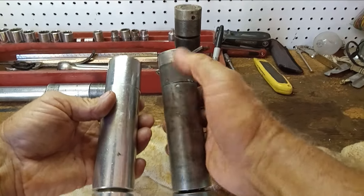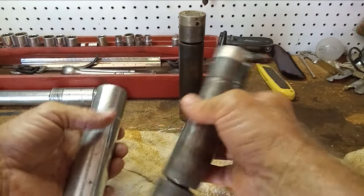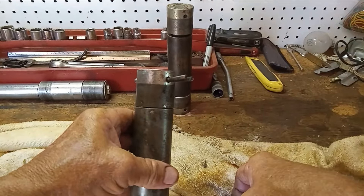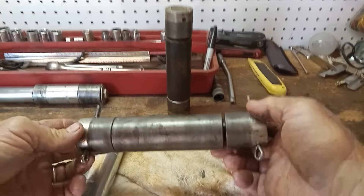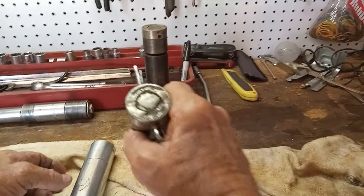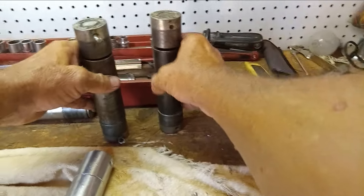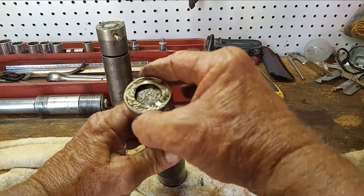When this is enclosed inside that sleeve in the boom with these cotter keys holding these caps on, the only catastrophic thing that could happen is if you lost or sheared off a cotter key — then this piece would obviously come off and bad things may happen because it could all fall out. But other than that, that would be something very easy to monitor; you can see the cotter keys very easily on the machine. And it amazes me — think about this: during seven and a half years of operation the cotter key held up, but the weld broke. You can see the crack, and on this one that doesn't have the cotter key, it will come off — you can slide it on and just twist it till it fits right back in place.